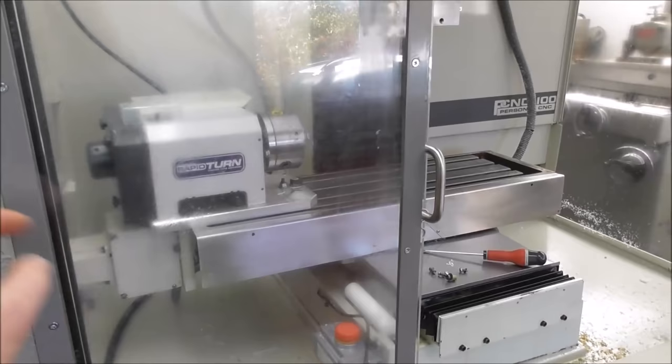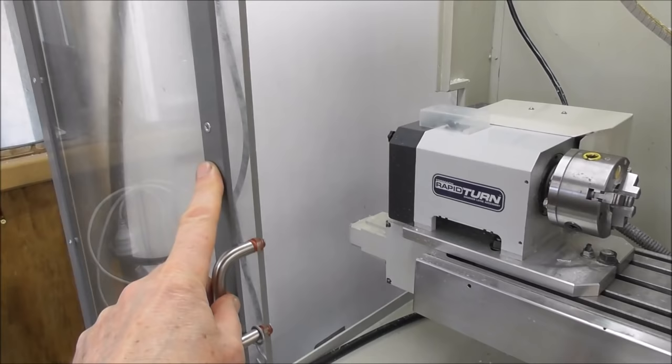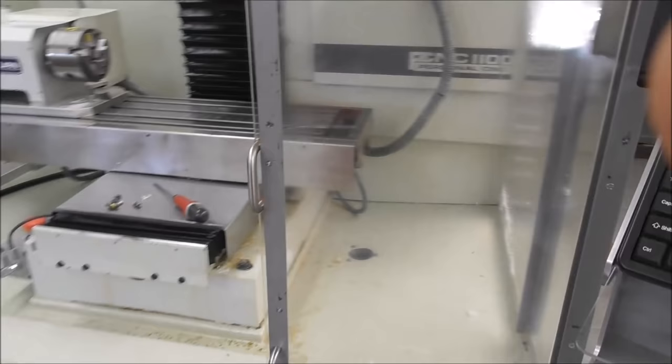And this strip on the front can't be angle iron because you've got the sliding door. That's a piece of inch by 3/16 would be the nearest, or 25 by 5 black steel bar. They're the two key dimensions for these doors and for the framing: inch by inch by 1/8 angle, and inch by 3/16 flat strip.